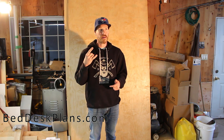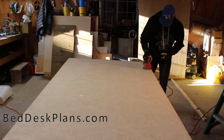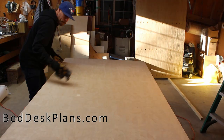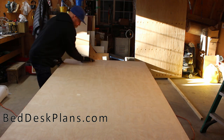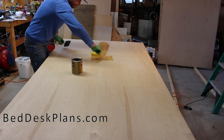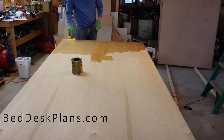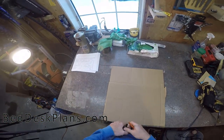I've got the first coat of finish on the panels. I'll let them sit for a couple of hours before putting the second coat on, then flip the panels over and finish the other side — some panels get finished on both sides, two get finished on one side. I started by sanding with 220-grit sandpaper to remove any fines, cleaned it with a microfiber cloth, then finished the boards using polyurethane — you could use Varithane or paint them any color you want.